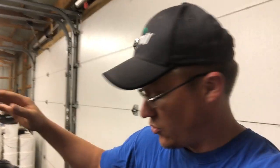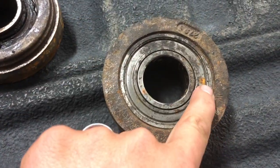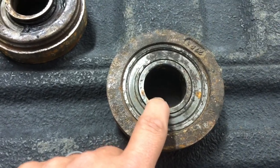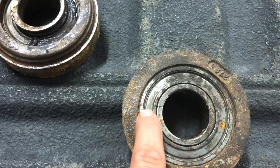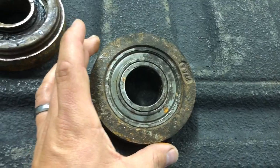All that said, we worked on the round baler a little bit. It got dark so we didn't get a whole lot of footage, but we took some rollers off. I'll include the part numbers and show you the rollers I'm talking about, as well as the bearings on those rollers. There are multiple bearings — I'm going to show you them right here on the tailgate of my truck. There are two bearings here that came out of the same roller. This bearing is locked up — I can't turn it — that's why I'm changing it. There are two separate pieces: the bearing itself, which is a ball bearing containing your inner race, your balls behind the seal, and your outer race — and then this piece of machined cast, which is a bearing housing.